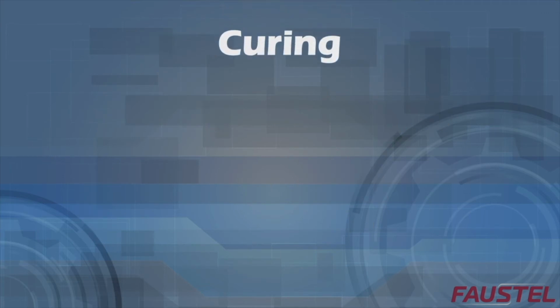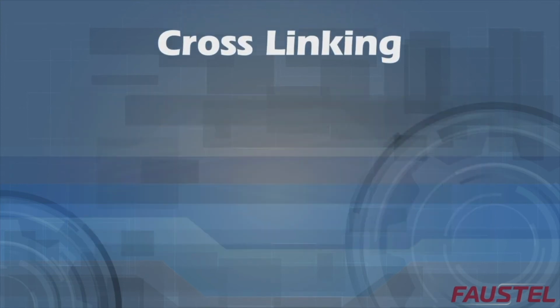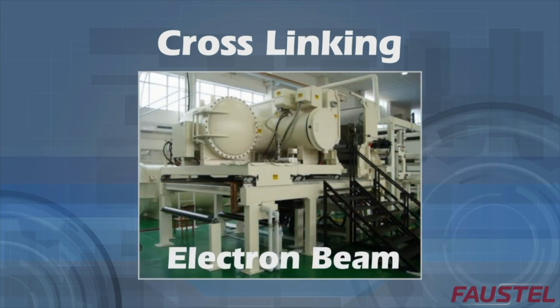The second method of dry bond lamination involves the use of UV curable or cross-linking adhesives. In this situation, a laminated structure would need to pass through a UV or electron beam system in order to cure the adhesive prior to lamination.